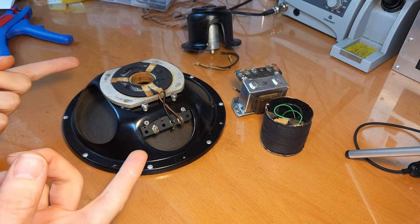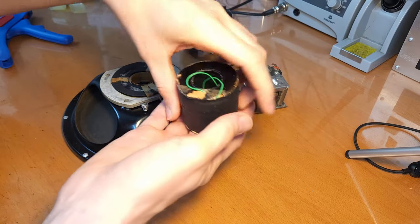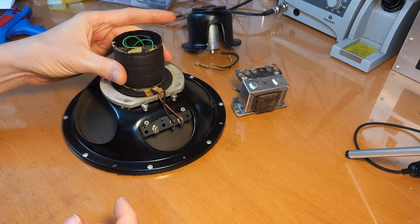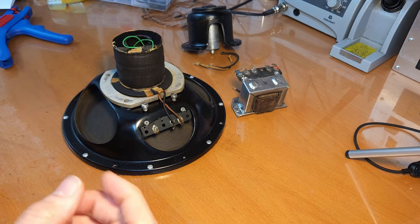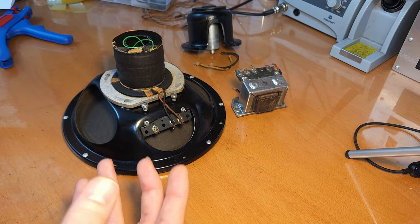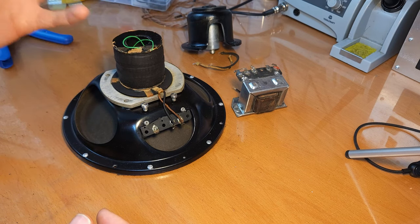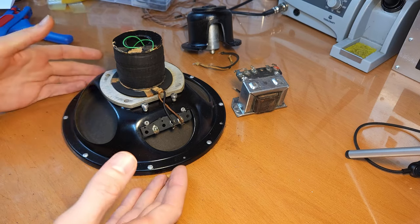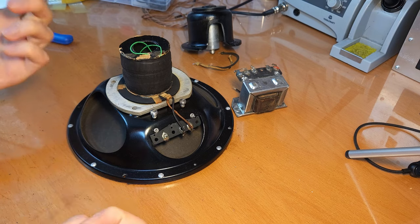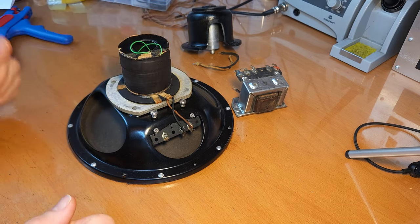So you use an electromagnetic coil, basically. So this is the field coil that we were talking about. It acts as a magnet and it sits over here. And it also energizes the voice coil and really acts as a magnet. Now, the disadvantage of this is obviously that you need to put a constant current through it, or you need to energize it actively. So when you turn on the radio, this gets energized and then starts acting as a magnet.